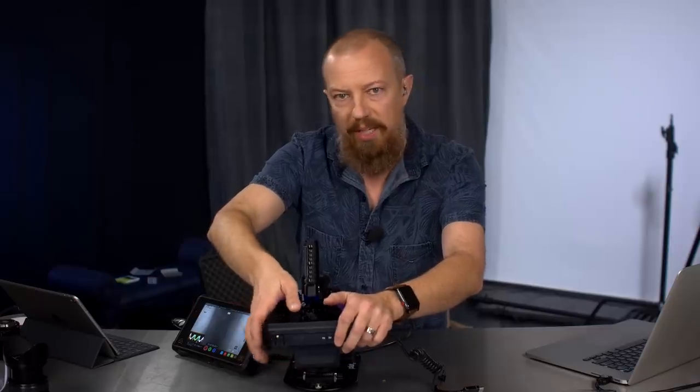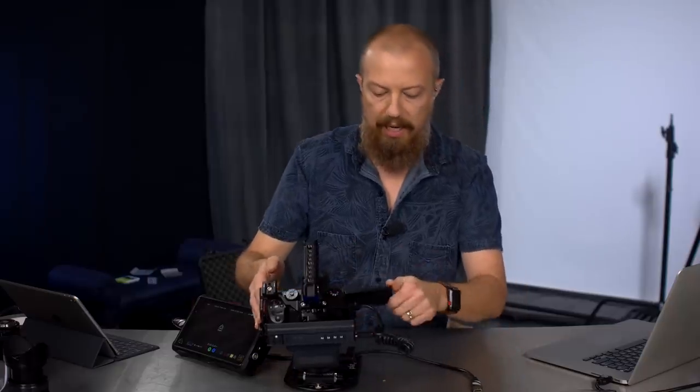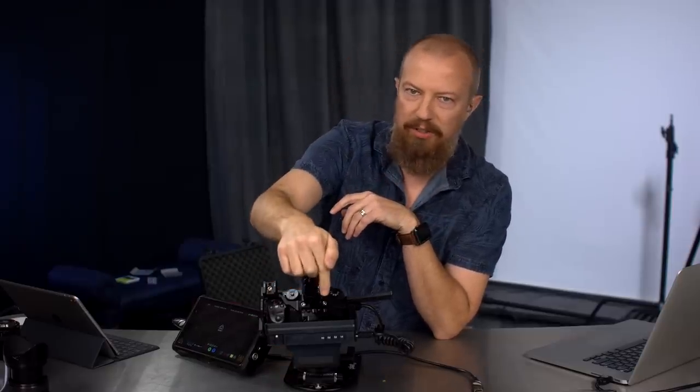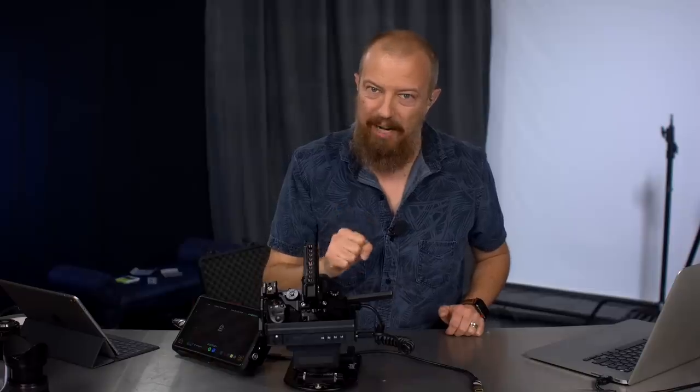What this tells us as well is that the camera doesn't know there's an Atomos here — all it knows is that there's an HDMI device connected. So why is this a problem? This device that is currently connected is not a recorder — it is just a monitor. I've just set everything up to trigger recording on the Atomos. Now I'm going to unplug the Atomos and plug in my external monitor. I push the button on the camera to start recording, and the camera tells me it's recording — it tells me it's recording up the HDMI out. But it's not recording. Nothing's recording right now because this is just a monitor. The camera sent a record command and this device just threw it away.